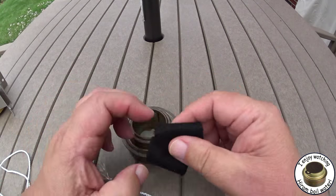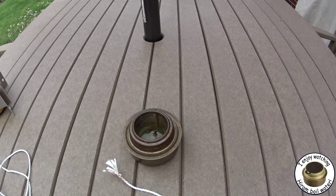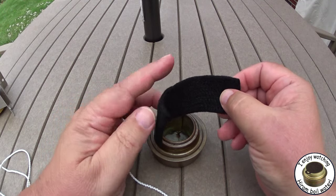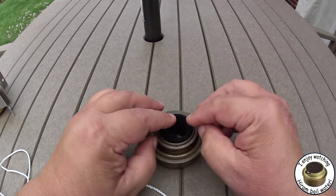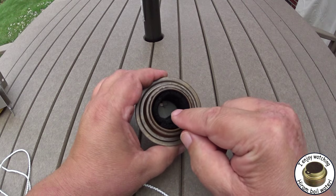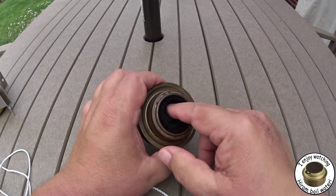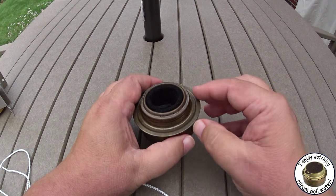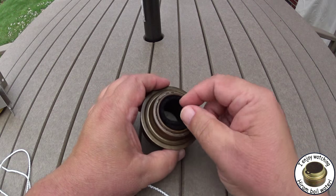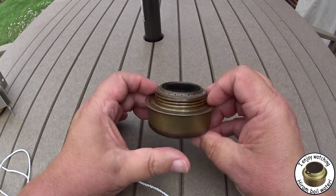Another example of where wicking on the outside might not help: the wicking on the outside acting like an insulator is the same thing as when we put carbon felt on the inside to make for a nicer flame. If you've noticed, it slows down the burner heating up because even though you have a flame on the inside, the wicking acts as an insulator. There are certain times when this comes in handy, especially when simmering — it gives a much nicer flame. But for starting up the burner, it's not a good situation.